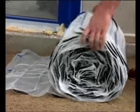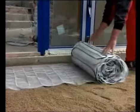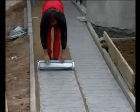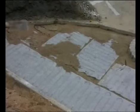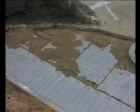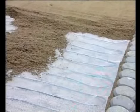Ecofloor floor heating mats can also be used for exterior installation to prevent pavements from icing. The correctly shaped heating mat is rolled onto the prepared surface of soft flattened sand according to the laying plan, and its electric value is measured. The sand must not contain sharp pieces. The heating mat is covered with sand and is connected.